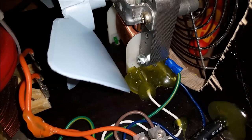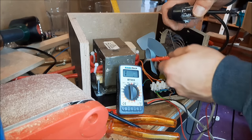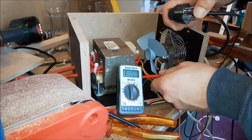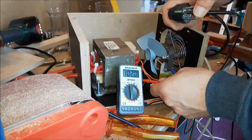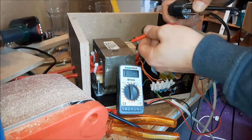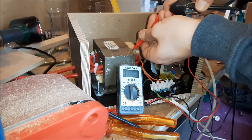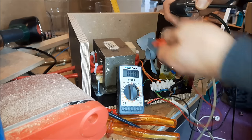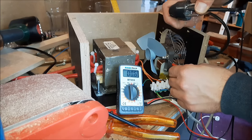Here you can see the protective earth cable connected to the iron core of the fan. Additionally, both terminals of the fan are exposed, so I covered them with hot glue. To check if the protective earth is connected properly, take a multimeter, set it to the lowest ohm setting you have, and then check for electric continuity between the wall plug protective earth and all metal parts. In the case of the transformer, you may have to scratch the surface because it's also covered with some insulation like the magnet wire. If the multimeter shows around one ohm, then the electric continuity is okay.